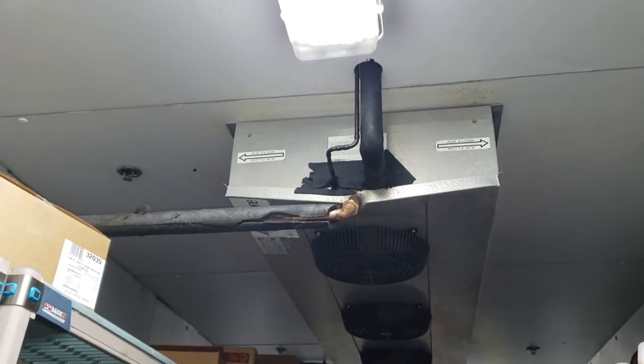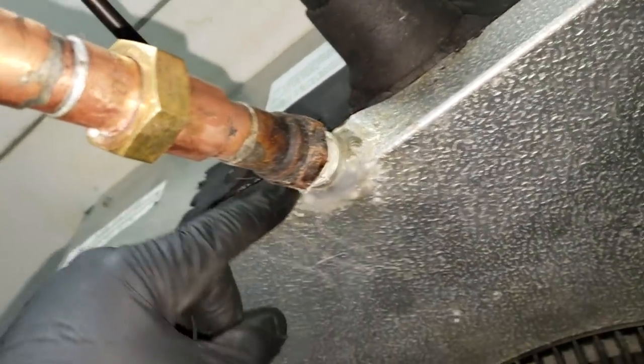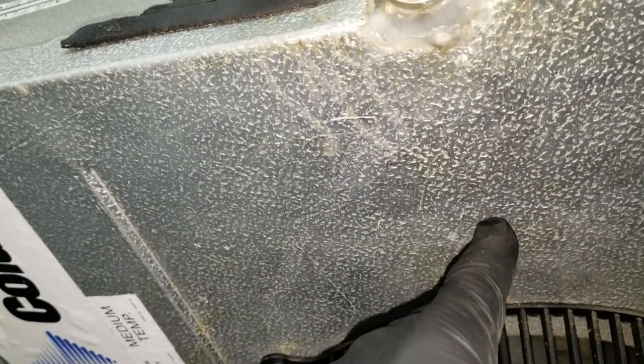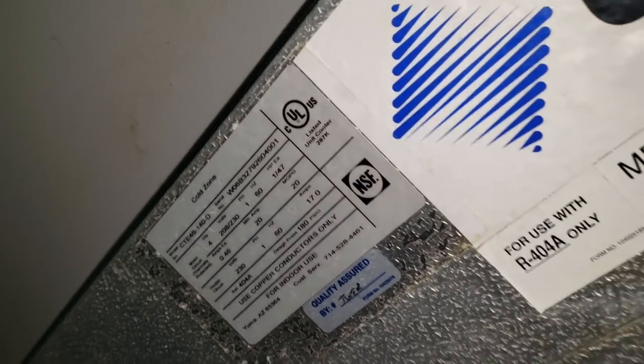Nonetheless, we're going to get this thing blown out and verify it's not a plugged-up drain line. The first thing I want to point out is the reason why I have this drain pan ordered. If you guys can see these little dimples right here — your finger can get caught on them — those are actually the drain pan rotting out. If I took something sharp it would poke right through. You usually notice them right around here, and someone has silicone on there because it was leaking. When you see these little dimples and the metal's pushing out, if you go on the other side you'll notice the aluminum is corroding on the inside and poking out. We've got this drain pan ordered — it's going to be a couple of weeks because it's an old unit from 2006, so they have to custom make it.